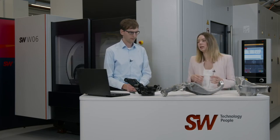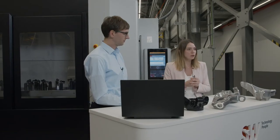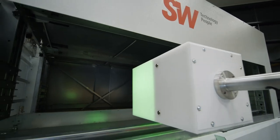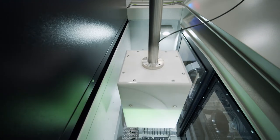You were talking about how we have solutions for clamping errors — do these kinds of errors normally occur during loading? We've been talking about having six components clamped at once, so that workpieces can always be replaced, loaded and unloaded. SW is more than just a machine manufacturer. We don't just offer the machine, fixture, tools, process and turnkey project, but also automation solutions. We have many different concepts — standardized solutions for one or two machines like the top rob or floor rob, and we can also offer specialized solutions, completely linking 15 machines or however many you need, including a brushing cell, washing cell, or labeling cell. We would be happy to provide a complete system solution.